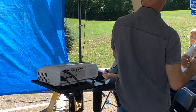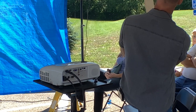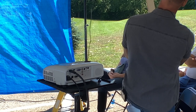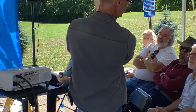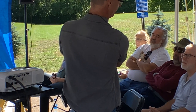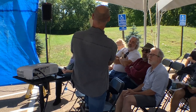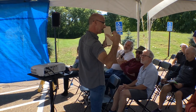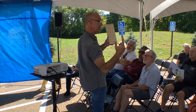If you really want to pay attention to detail on this, you rip this so that this and maybe this and one more are your face frame and door frame pieces. And we have two things going here. One, that's given me nice straight grain for the router table. The other is the aesthetic.